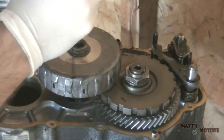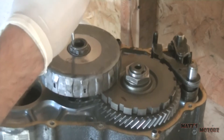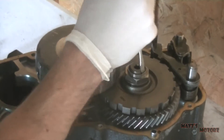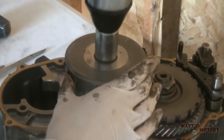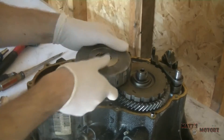These nuts on the top — you have to first tap the little dent in the side to be able to turn them off. You can't do it without doing this. Just tap them to make sure everything's straight and you can turn the nut off without too much trouble. And these are left-handed threads, so you need to turn them to the right to loosen them.